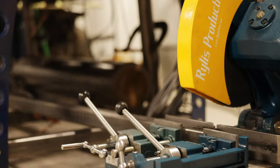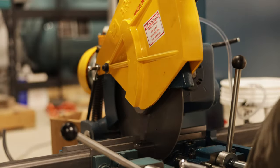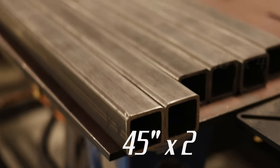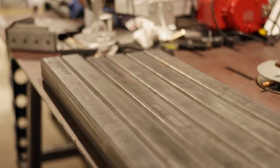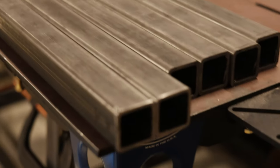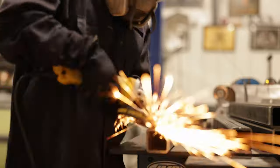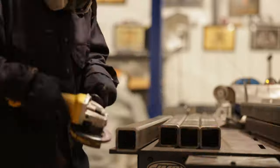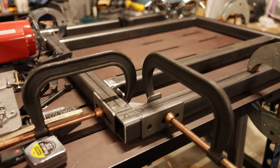The Brobo cold saw makes short work of the square tubing. I'm making the cut straight so I don't have to miter them, and it's easier to construct that way. I cut two 45-inch and four 40-inch pieces to make a 45 by 45 square. Prep is key and you really have to take off the mill scale on these tubing pieces — it's coated very thick.